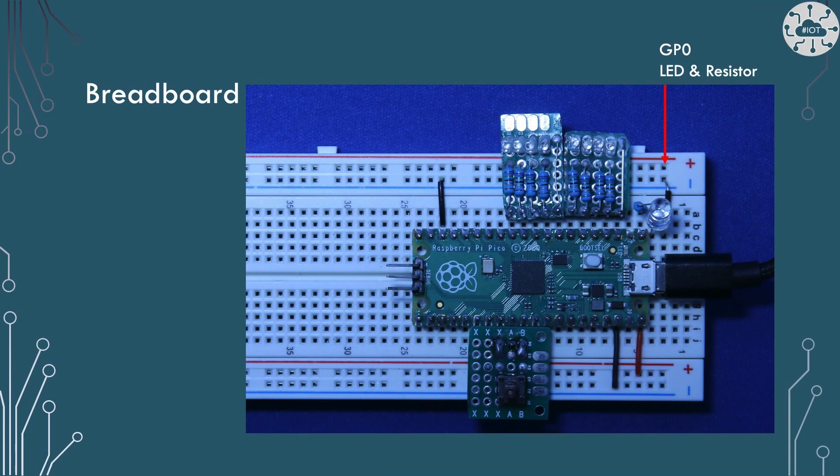I've got a five millimeter LED connected to GPIO zero via a 75 ohm resistor and then to ground, which I've pulled onto the ground bar at the top of the breadboard. I cheated a little for the other eight LEDs and used a homegrown module. Using 1.8 millimeter red LEDs you're able to put the LEDs in a perfect line, which is great for this example. The modules are just resistors connected to LEDs and then to ground, making use of the fact that the Pico pinout has GPIOs connected in banks of four with a ground pin just before them, so a five pin module works really well.